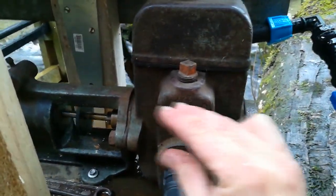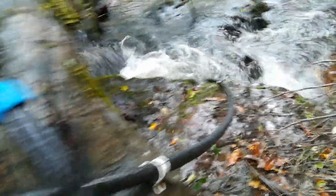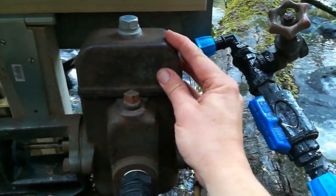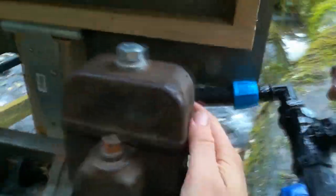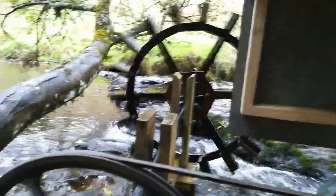I had to put new buckets on the pump — the buckets are in here going back and forward. It's basically just a big plunger that sucks water up from here, up into this reservoir, creates air pressure in here and pushes it out the back. The buckets go back and forward, powered by this, which is turned by that, which is turned by that.